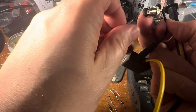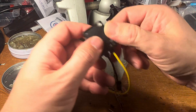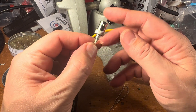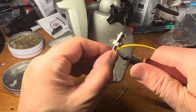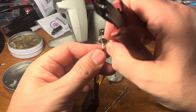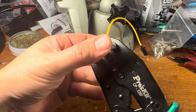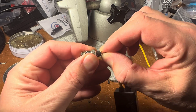A little continuity test on this too before I button it up. I just want to see that the center pin of the BNC is not touching the outer shell. It's not — good sign. We're almost there. I think we're safe enough to put this little swatch of Velcro back where it lives. We will cut these copper strands — they should not really go past this textured part of the connector. I just want to make sure there's no way any of these are going to get near that inside one. Good squeeze — yeah, that felt good. That crunched it on there. That's never coming off.